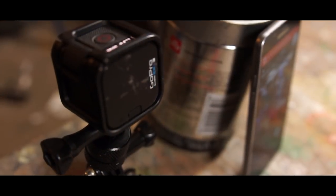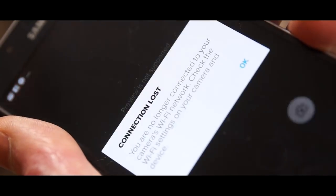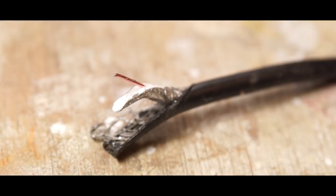One drawback of having a camera on the end of a stick is you can really only guess what you're filming. It does connect to a mobile phone via Wi-Fi, but once underwater that signal gets broken up and scattered by the water itself and becomes pretty useless. So I've been experimenting with using some TV aerial cable to link the two together. It's quite thick and not really flexible because it's got sheathing inside to stop the Wi-Fi signal leaking out. This is about four meters of external quality cable with both ends stripped to expose the copper about eight centimeters on each — basically aerials.